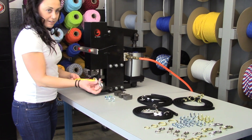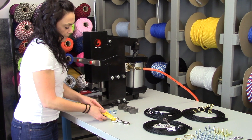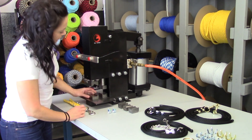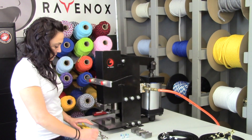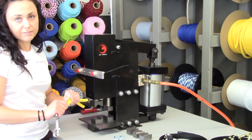Thread on a swivel snap here. Place the rope inside the rope clamp. I'm going to place it in position 1 — and you want to make sure you have your dies placed right in. You're going to use a die set that corresponds to the size of the clamp that you want to use, so we're using the set that works for the 5/8 inch.